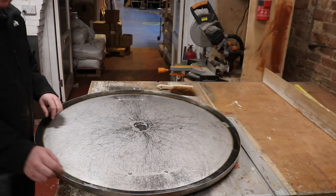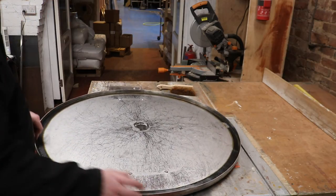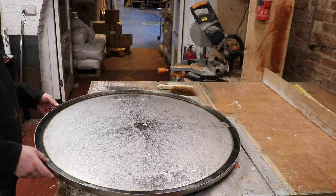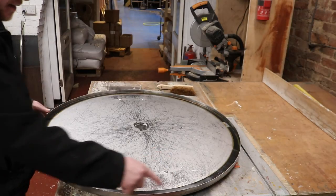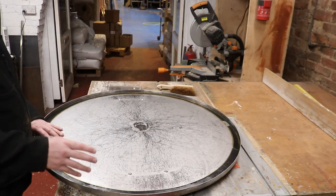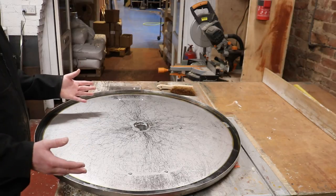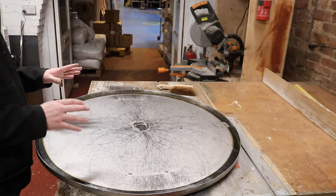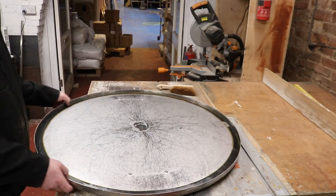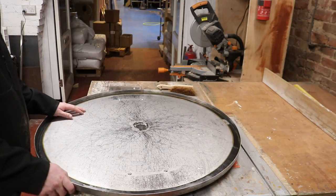Due to the way that these particular fermenters are designed, the tops of the fermenters are just the edges of the steel sheet, so you've got a two millimeter or thereabouts lip, and that meets this lid which is flat steel with the band welded on all the way around it. Because of that there are minor imperfections - bumps and divots all the way around due to warping from welding the stainless steel. They're not totally obvious to the naked eye but they are there, so when we're cleaning inside the tanks any cleaning products or water coming out of the spray ball, which is centrally mounted, hits the side and can get around that two millimeter edge lip and drip down the outside of the tanks - which when we're using caustic is not an ideal situation.